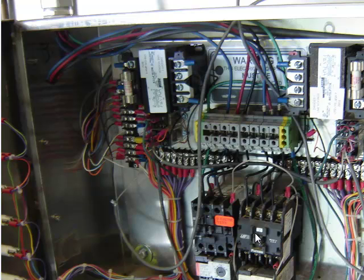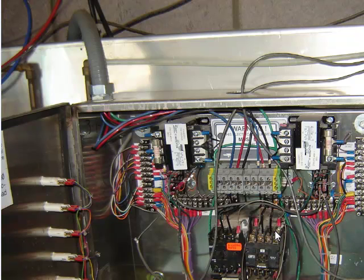Basically all it was: the coil had melted for some reason and it wasn't allowing the contactor to pull in. So every time the switch was pulled out at the bay wash, it wasn't allowing that contactor to pull in and make contact. It was trying to suck in but it just wouldn't do it.